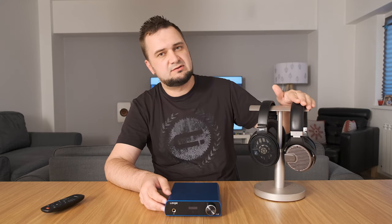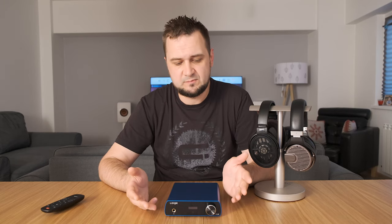Switching to full-size headphones, things get more interesting. I was comfortable driving my Sennheiser HD660 at about volume position 28 and my Quad ERA-1 at about 33 out of 40 maximum. For harder-to-drive headphones the D20 could be a problem, as it doesn't provide a lot of amplification in absolute terms — it doesn't have the authority of heavier and much more powerful designs. The slam is also not the best and is probably the biggest drawback of the D20, because heavy drum hits will not have that hard impact and double bass will sound a bit subdued and lighter.